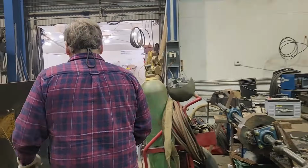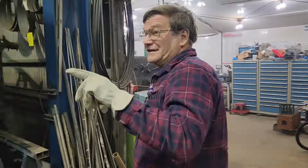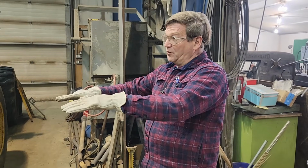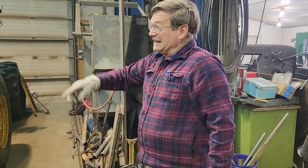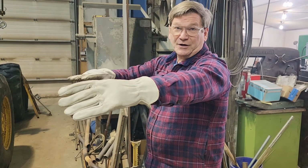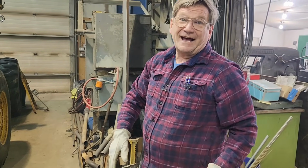This is closer to my other stories, one of them that I was thinking of, yes, was back to the 2-inch plate and something which made me think again even more of making sure that I had some movement in there. We had a lathe like that, a little bit smaller, at another shop, and the compound we had way extended out a long ways. We had some tooling on the end of a boring bar. We were doing just a little cut, and all of a sudden the compound went wham and broke in half.